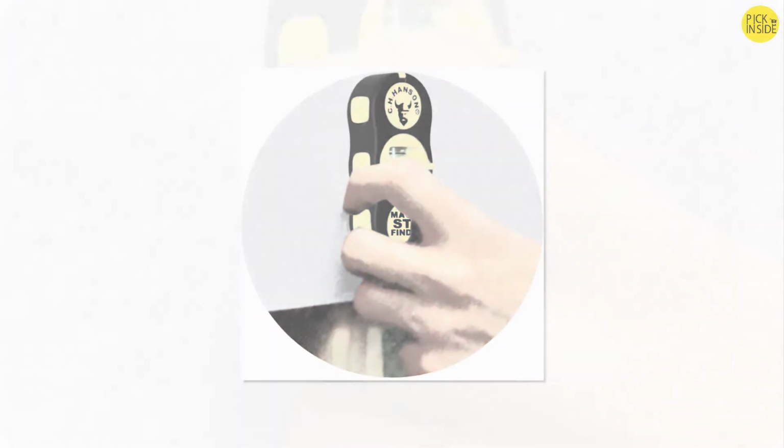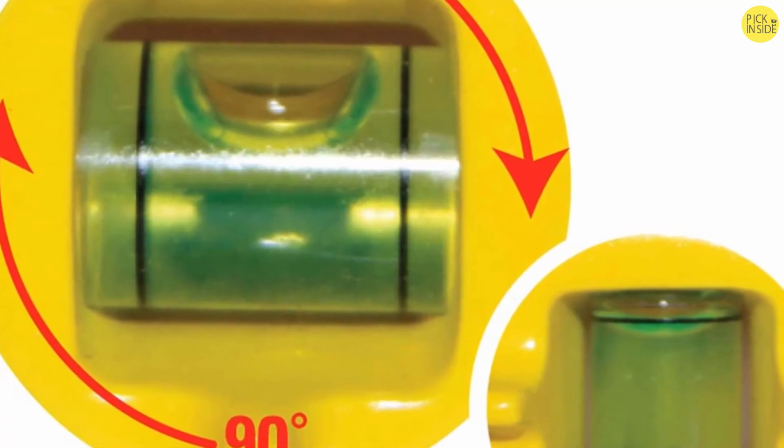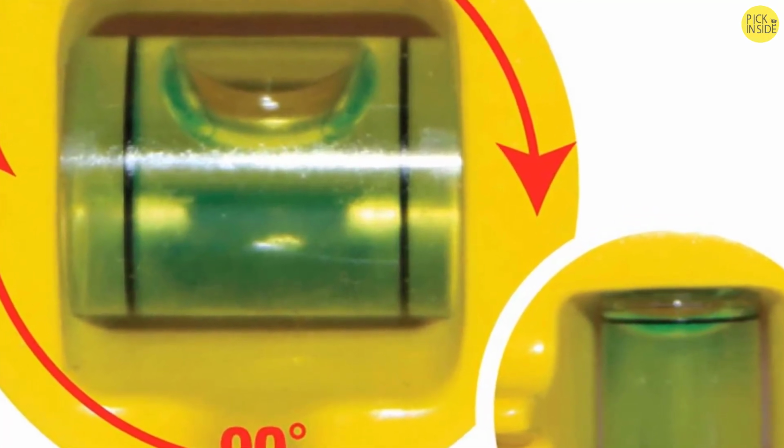Metal studs are located the same way, although it's easy enough to feel the magnet grab a little as it passes over a stud. Note that it may also pick up on any ferrous metal beneath drywall, like ductwork or electrical box.